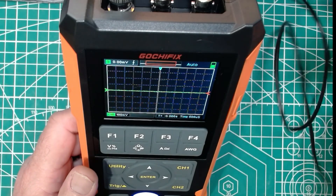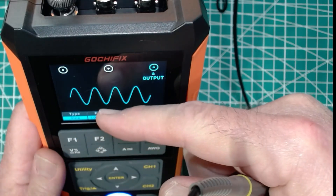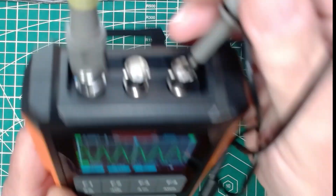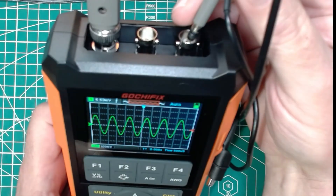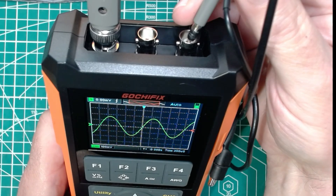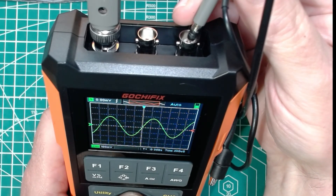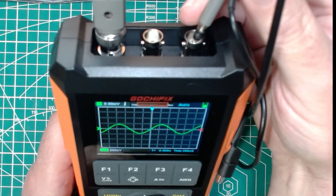Let's do a quick test of the oscilloscope and the wave generator. I have our waveform generator set to a 1 kHz signal at 3 volts peak-to-peak, outputting a sine wave. And as you can see, that does it beautifully. We should be able to adjust our time base — right and left — and we're showing 100 millivolts on our vertical scale, and I can change that as well.